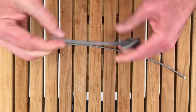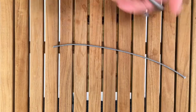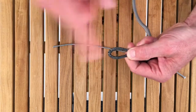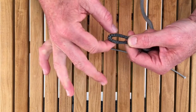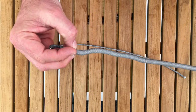We would run this through the stanchions, and at the stern we would strip back the jacket and terminate the jacket there, putting a 12-strand splice in. This would simply be lashed and tensioned to the stern pulpit, and you get rid of all that wire weight and all that hardware — this just runs from front to back of the boat.